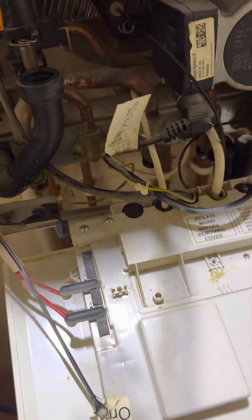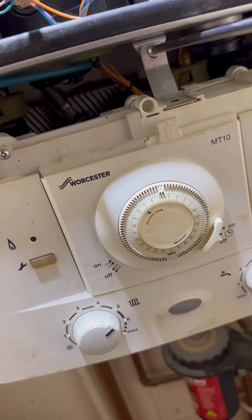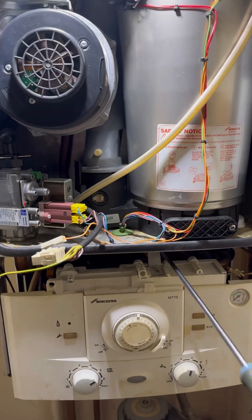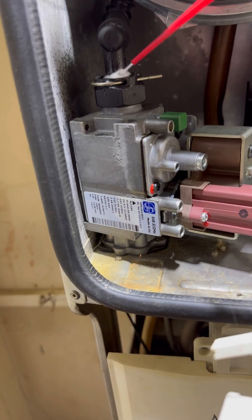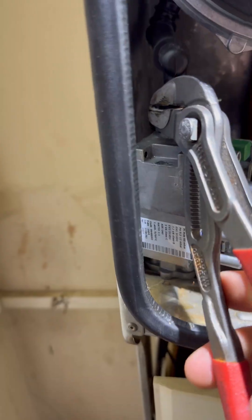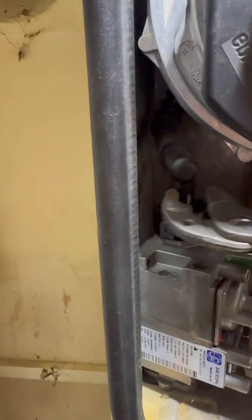At this point I close the drain off, disconnect the hose, and I shut that up so that no water gets on the PCB when you pull the heat exchanger out. I literally WD-40 everything, because nothing holds harder than a Worcester Bosch O-ring. I WD that because you'll see in a bit — I'll undo the flow pipe and pivot it round.